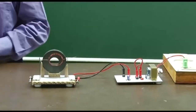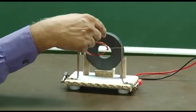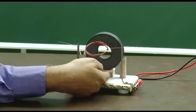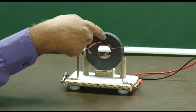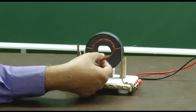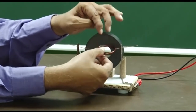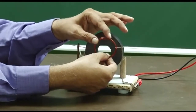And now there is a question. So, you can see that the coil is facing essentially this part of the magnet, this part of the magnet is quite far away for all positions of the coil. So, magnetic field is essentially from this part here. So, if the coil is in this position, essentially this is the part which experiences force, and when the coil goes here, essentially this is the part which experiences the force.